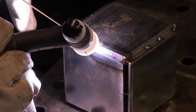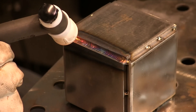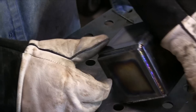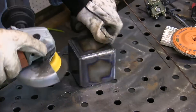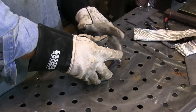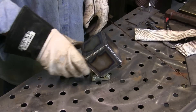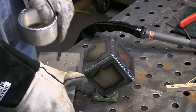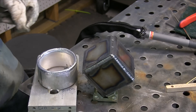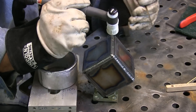This is just a really quick review. I put one single TIG pass in there using some 309 in some cases, some ER70, and different size rods. I also experimented with some pulse settings using a 3/32 diameter rod. Once I got all that welded up, all the sides welded up, I buffed them out real good with a wire wheel while it was still good and warm. That's important for making things flow good. I want to position this cube where the welds are right exactly at the top, because silicon bronze just kind of flows like water, like honey. If you don't have the weld at the very top and you get it a little bit too hot, it'll just sag to one side. So I'm using random pieces around the shop to get my hand propped up right where it's comfortable.